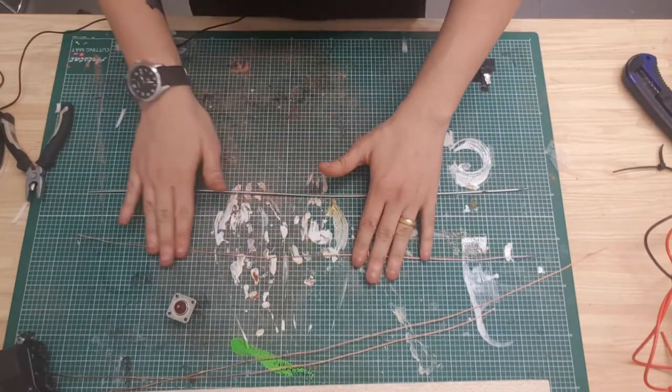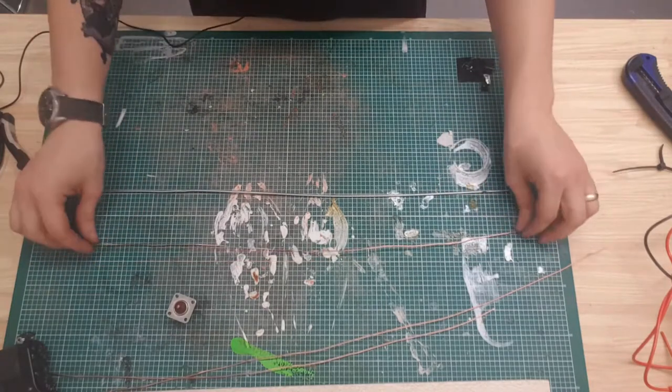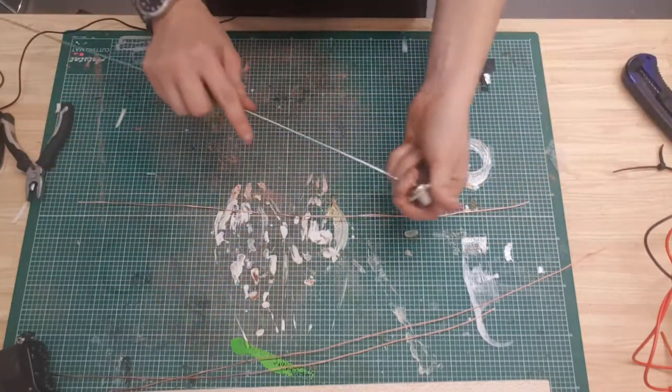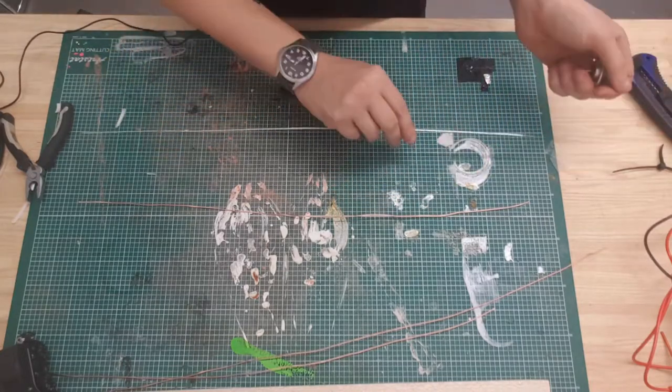Your radials need to be slightly longer than the antenna. Now, you might be looking at those going, they're about the same size. You'd be right, but I made this slightly longer because part of it actually slots into the shielding.